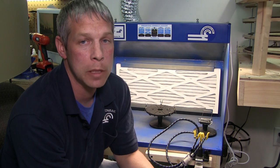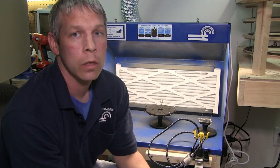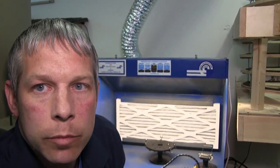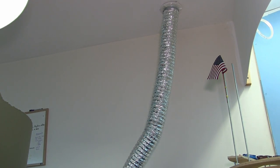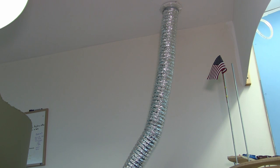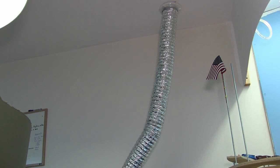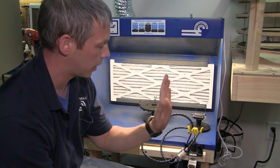I have seen people that have adapted Andy's design and made their spray booths out of wood, so there is no reason why you can't use wood. Regarding the duct: you see the duct in the back — that collar up there is a quick disconnect collar I found at Home Depot. They're used for dryer vents and I like them because they're easy to snap on and off. I connected it up to the collar and put a four-inch hose clamp and tightened it down. There's no leakage up there as far as I can tell — I went up there with some feathers and I couldn't even feel anything. I also put a little piece of wood down here so I can put my clamp in for my stand to hold my airbrushes.